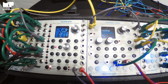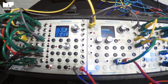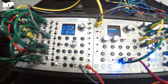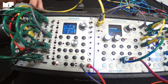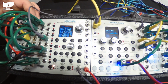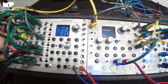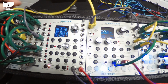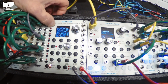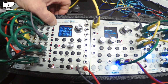How does it handle, or will it, when it's finished, sort of right up to audio rate on those CV-ins? Yeah, all the CVs are sampled at the full audio rate, so you'll be able to do audio rate modulation. If you want to do external phase modulation with an audio signal, it'll also come in through one of these CV inputs and things like that. So yeah, everything's DC to full bandwidth on everything. So the other thing we've got in the sample, in addition to being able to gate the sample, we also can loop the sample. So again, getting back to our friend the trumpet here.